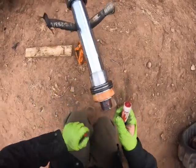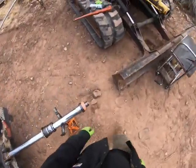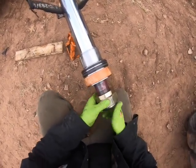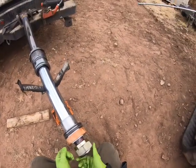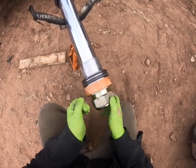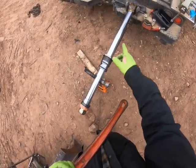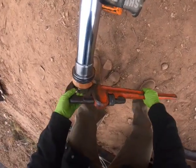So, yeah, next time this thing comes apart, there's probably not gonna be avoiding using a torch. So get this guy on somewhat quick. That gel doesn't seem to really set up fast like the liquid, but some of the liquid stuff sets up pretty quick. But oh man, before you put your gland on, polish that rod up. Make sure it's really clean.